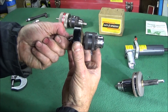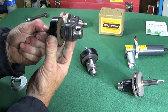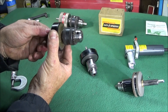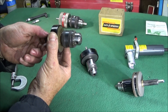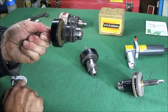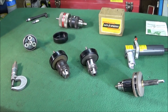In use, this was put into the drill chuck and then the mason bit goes in this chuck here. Start the electric drill up, then grip this with the thumb and finger and that starts the chuck up at slow speed and high torque so you can drill into masonry. If the mason drill got stuck, all you would have to do is let go of the outer ring and the chuck would stop turning — that's why they call it a safety speeder.